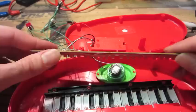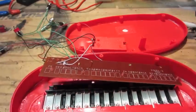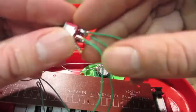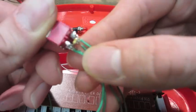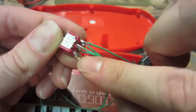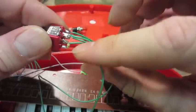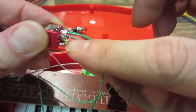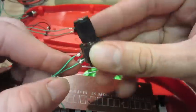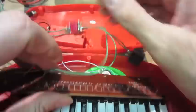And I still have to add the pitch control. I removed the original resistor, took it out to a switch, and soldered the resistor on the switch there. So when it's switched up like that, it's actually going back through the original resistor back to the circuit. When you switch that, it runs it out to the pot here.